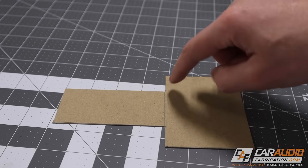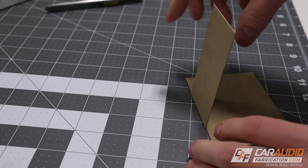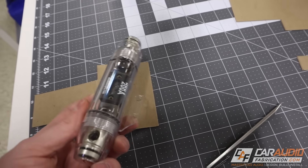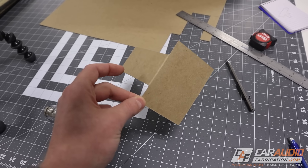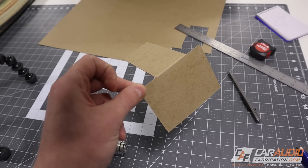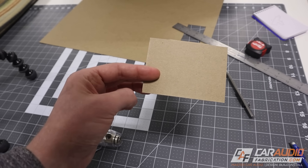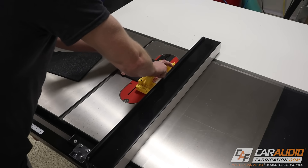Here's the flat layout of my bracket. A good trick to get a nice crisp bend line is to take a knife and lightly score that edge with a ruler before making the fold. Let's do a test fit real quick in the vehicle — I want that part to mate up to that inside surface there. Looks like we're not going to have any interferences, and we have plenty of room for the fuse holder on here as well. We've proven our design — it's not going to interfere with anything, and we've only used a cheap piece of cardboard. If we made mistakes, we could just cut another one or trim and modify it very quickly. When we fabricate this out of plastic, we'll clean up the corners and refine the edges — there's no point doing that now.